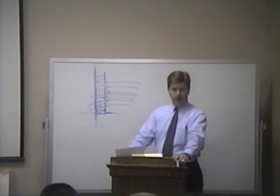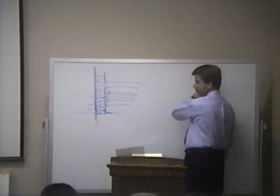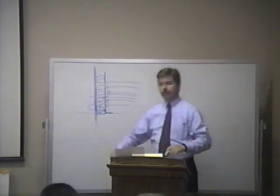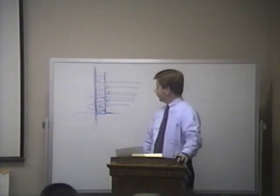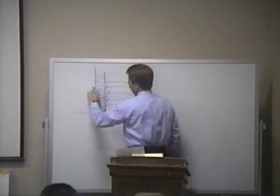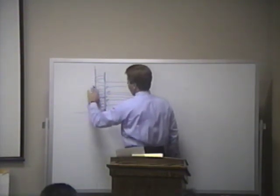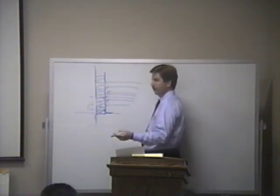You know, remember that? And you could put it in the attic and have it sag between the joists, and it could be an R10 or some phenomenal numbers. What it is, it's reflective and reflects back heat in that cavity. Well, the only problem is you've got to have the cavity. You can't use it with frame construction. You can't use it with stucco. You can't use it with a lot of constructions.